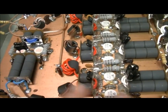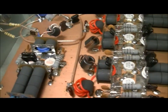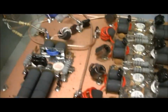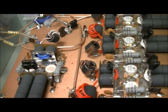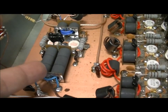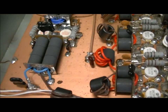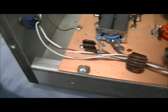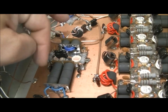To be honest with you, whenever I install any of my transformers, my 1.5-inch or pretty much any of them, I go ahead and put standoffs on them already. You never know what's happening. Once heat gets to these amplifiers, they'll start shifting a little bit. The transformers will start dropping a little bit, etc. I have seen it happen. I've only had one amplifier where it has happened, but it can happen where the back of this transformer touches this board right here and shorts, and then you got a serious problem on your hands, blowing all transistors pretty much.